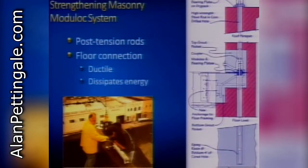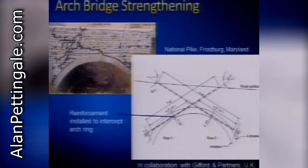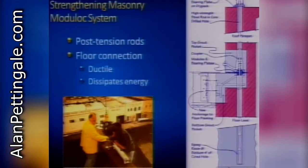It's not easy to get the rod out of the wall - we haven't figured that out yet. You have to contend with electrical conduit in walls; you need to map that out beforehand or reroute electrical around those areas. On this particular historic building, all conduit was face-mounted so it wasn't an issue, but on other jobs it's been a big problem. This technique is also used for strengthening of historic arch bridges - drilling at a precise angle so the reinforced core holes just kiss the inside of the arch at the vulnerable quarter-point hinge locations, which increases the load rating.